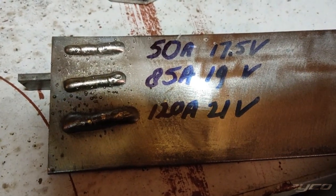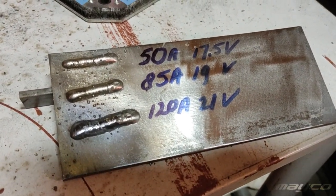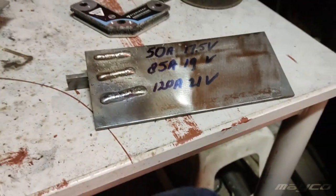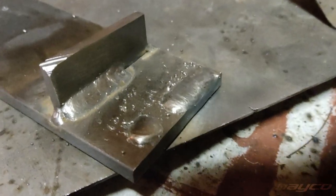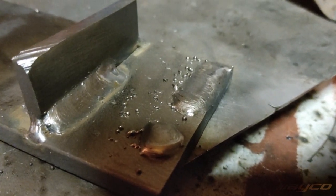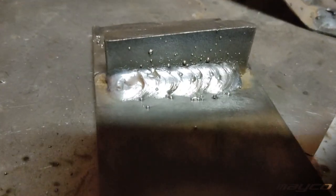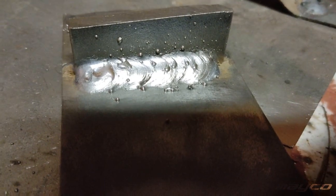This episode we started off with this couple welds. And now I just want to show you another version that I have. So this is, I believe, 8mm thick plate, and I welded it with 160 amps 24 volts. Now this is just a regular weld, just on the material, and then this here is a chamfer weld. It is a beautiful weld. Beautiful weld. And here as well, this one's a little bit bigger, but also beautiful weld.